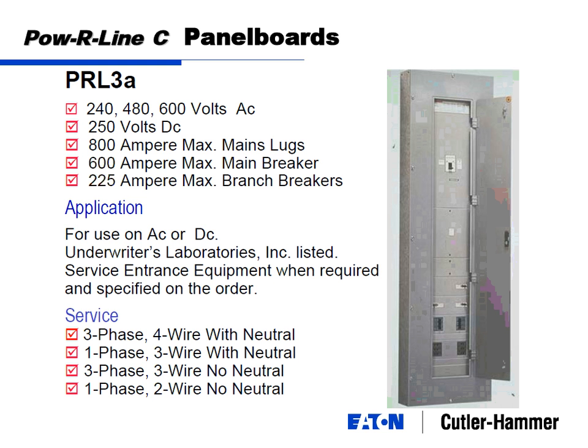And then the other thing, notice we added no voltage restrictions on three-phase, three-wire with no neutrals. So from that standpoint, it's a good industrial panel, industrial facilities that have a lot of motors. Sometimes you'll have no need for a neutral. They'll use these panels more frequently.